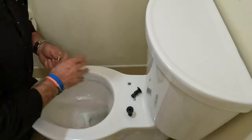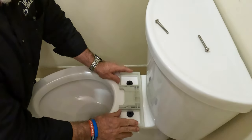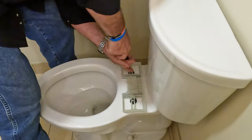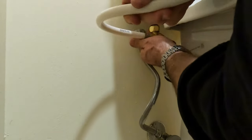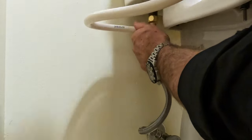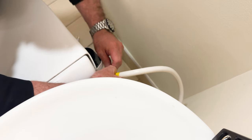Here's a pretty neat trick: I take the screw and start it in the rubber, dip it in the water, and literally push down on the screw. It extends that rubber bulb out where it slides right in there, then I pull my screws out and line up my seat. I'm centering it between the seat and the tank because I've installed these before, so I know about where that works out. Take the screwdriver and tighten it up so it does not move around. Once you get that done, disconnect the water — I've got a towel under there. We want to make sure we got it all; I didn't want to make a mess or leave anything going downstairs. Put the bidet tee in, tighten it up to the fill valve, then hook your water supply line back up. At that point it's literally very easy. Slide the seat in place — it will lock in. Then attach your water line to the seat with connectors to make sure the pressure does not blow it off. Then clean it up and make it look good.